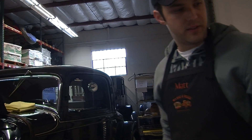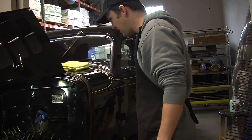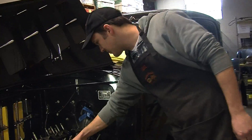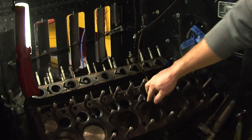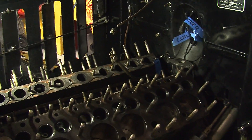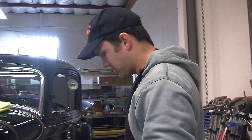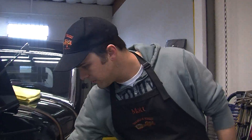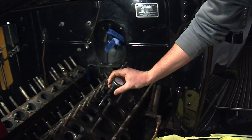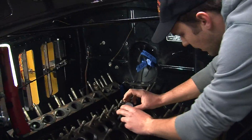So what are you doing? Well, this has a big V12 in it and we're cutting seats. Your valve seat to your valve is a very important seal because that's where you're making all your power. So you've got to test them, make sure that they're good. You take a little gauge here and you can check the concentricity of the seat.